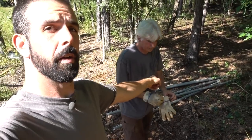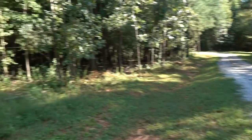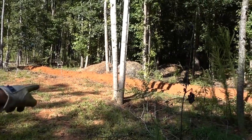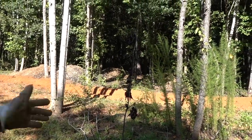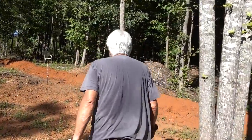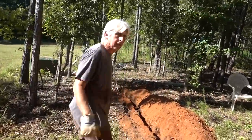We've got to put all that conduit on this PEX to go under the driveway that will eventually be here. Our drive's coming this way and we're going to turn off and probably shoot right through there. We're going to have conduit all out in that area where we could possibly be crossing — about 50 feet of conduit should definitely cover the space that we may have a driveway. The conduit's just a sleeve to protect the pipe. You'd be amazed how much the ground moves — you can really tell it on a construction job when a dozer goes by because it literally vibrates the ground.